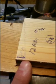Now if your ruler does inches, it is actually 15/32. Now the ruler I got is very accurate. It goes down to 32nds. Not all do. So if you round down to 7/16, you'll be like 6.7 degrees or 6.8 degrees. Close enough to work. The important thing is just to make them all the same.